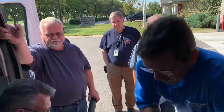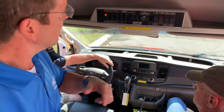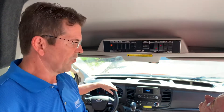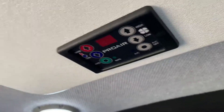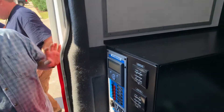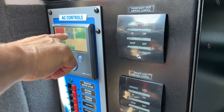So I'm going to show you that right now real quick. If you're on site, we can start the engine and that'll kick the shore power off. I'm going to put this on medium idle. We have a medium idle and a high idle. The AC for this truck is primarily just for a ton of chargers. We've got a bunch of outlets for chargers, but this air conditioning unit is a DC powered air conditioning unit. So if it's a hot day and you want to run that AC, put the truck in high idle mode so you can run the AC without worrying about the differential on the battery power.